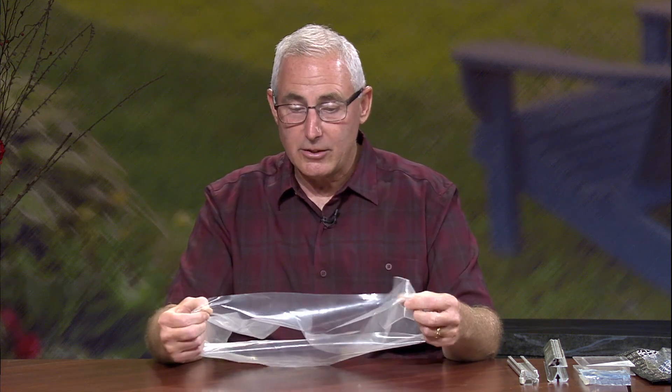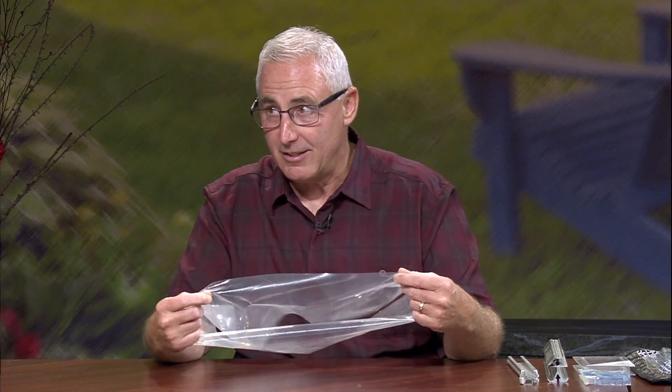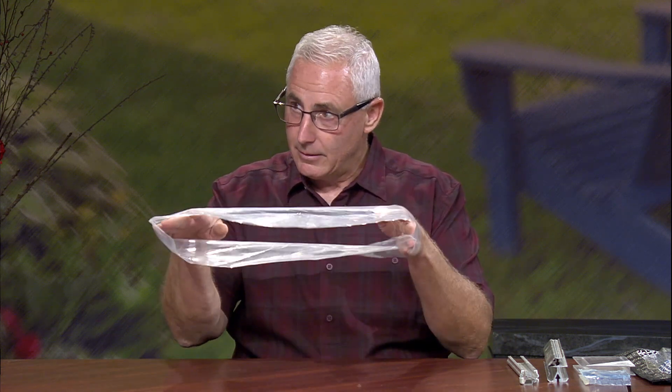Polyethylene, energy-conservation-wise, is a terrible insulator. What we do in the industry is inflate it about four inches deep with two layers. This is not regular construction plastic — it's greenhouse-grade, UV-light-protected plastic. When we put that double layer in, we can get some insulative quality. A single layer of plastic would add about 25% more heat load; by putting two layers, we can knock that down to 70% of the single-layer standard.